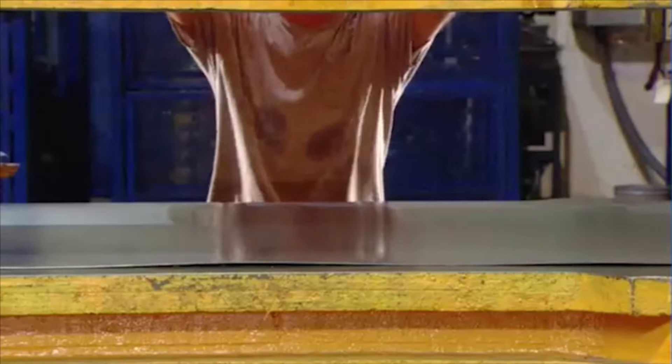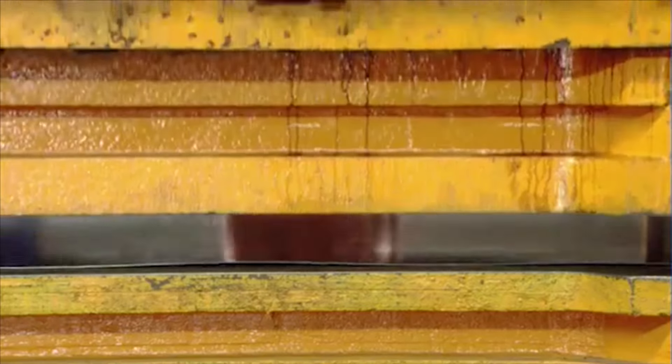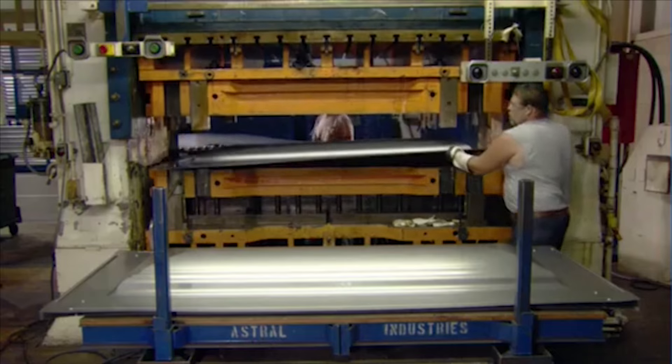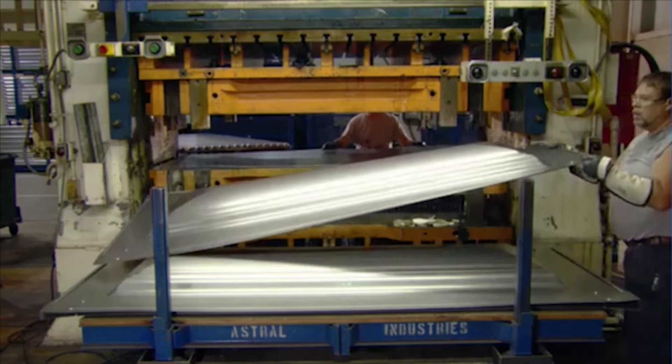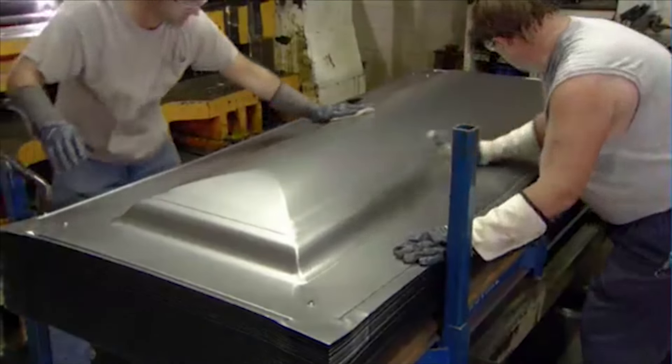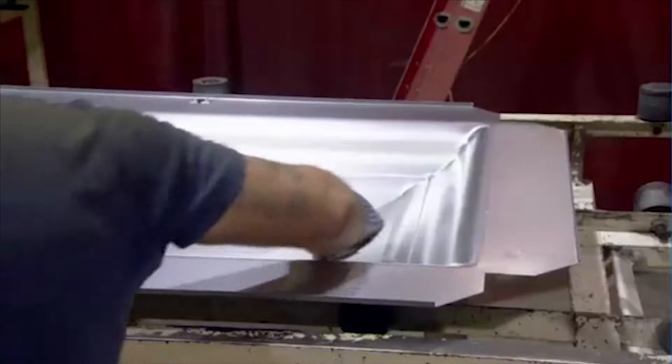This factory makes metal caskets constructed from sheets of steel. To form the top, workers insert a sheet into a press. A die inside draws the metal into a paneled shape. This requires 900 tons of pulling force, the equivalent of hoisting 27 fully loaded tractor trailers.